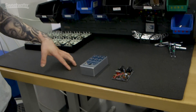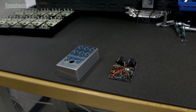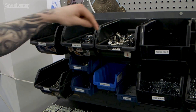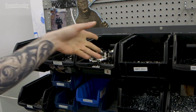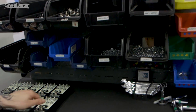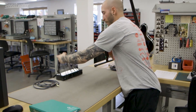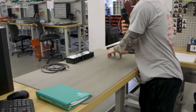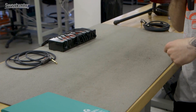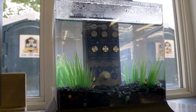The next step is assembly, where the boards finally get paired with their enclosures. Here's an example of a blank C-machine enclosure and a finished board, along with all the hardware components: momentary stomp jacks, in and out jacks, our original stomp jack, bezels, nuts and bolts. Here are some populated and assembled Afterneaths. After the boards have been assembled, they're ready to be wired and tested. We hook up about 10 pedals at a time, apply the knobs, line them up in a row, and individually test every single pedal. We have our guitars and amps, and we're playing every pedal before it leaves the shop.